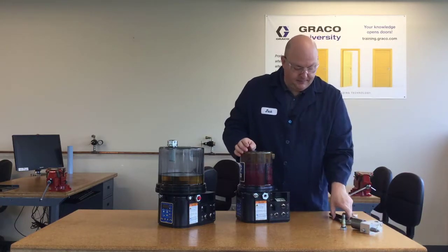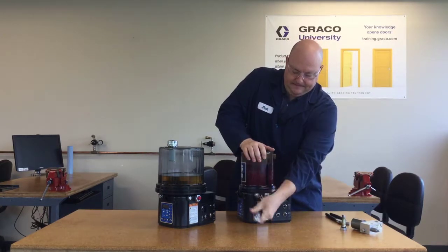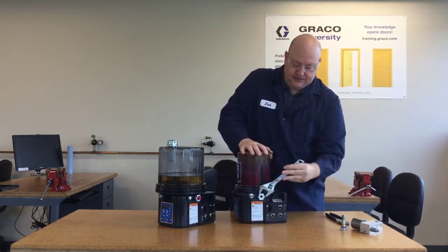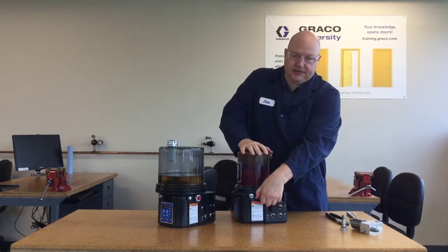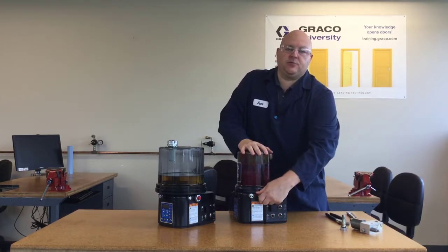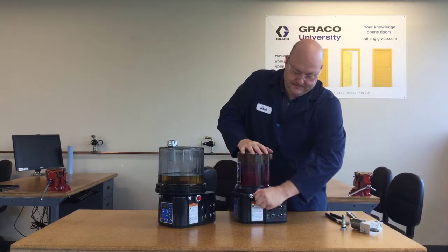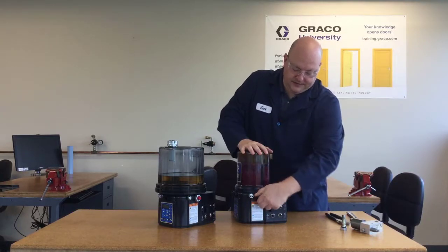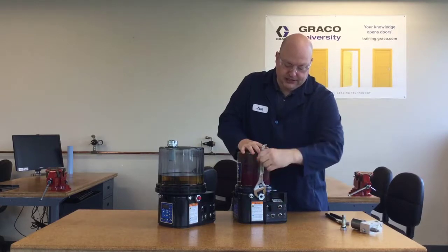Now we can see the pump element. It's a size I usually don't carry a specific wrench for, so it's fine to use a crescent wrench — it's not really going to be seized in there. This is another straight-thread piece with an O-ring seal, and you can mostly get it out with your fingers.